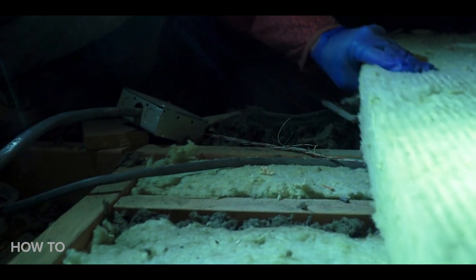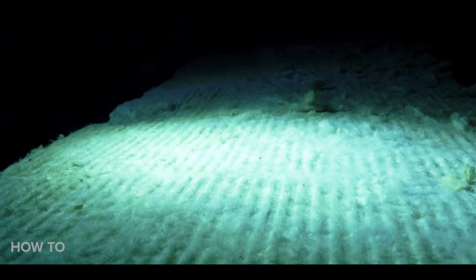Last but not least, we're insulating the attic space. If you insulate the attic before air sealing the attic floor, it's kind of pointless and has minimal benefit — fibrous insulation needs an air barrier to work as it was intended, which is why we're doing this part last. When insulating the attic, it's important to note that the insulation and air barrier should be continuous and contiguous, meaning they touch. The continuous part means it's more effective to have six inches of insulation everywhere, as opposed to ten inches of insulation in a concentrated spot.